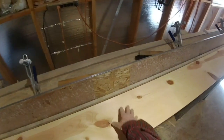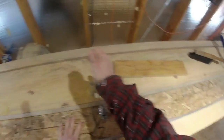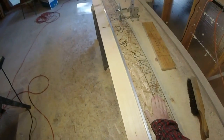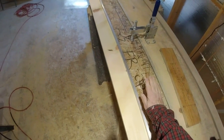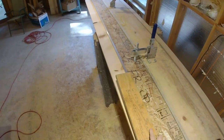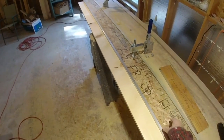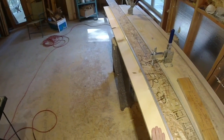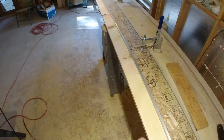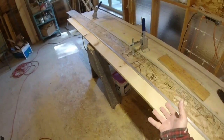Put the board up against the fence, put the straight edge up against the fence, and I'm ready to clamp. This works because I chose the width of my straight edge — the width of the straight edge plus the width of the material left by my saw together equal the finished width of all my material. So if you've noticed, I haven't used a tape measure to cut either side of my board. The process is purposely designed to go through the material quickly. I have a lot of repetitive cuts, so I don't want to spend time fooling around with the tape measure.